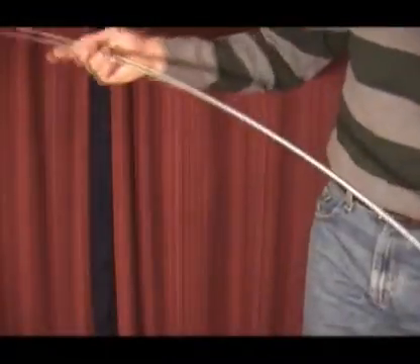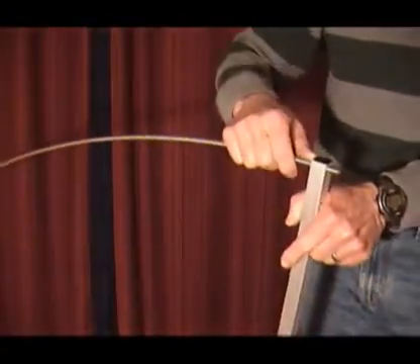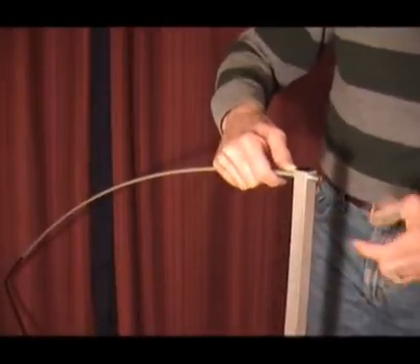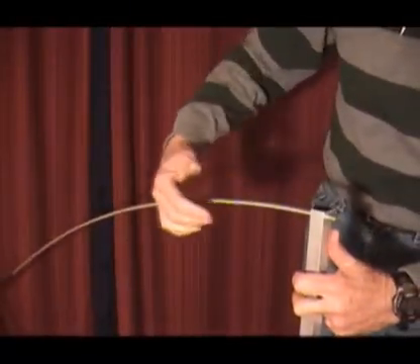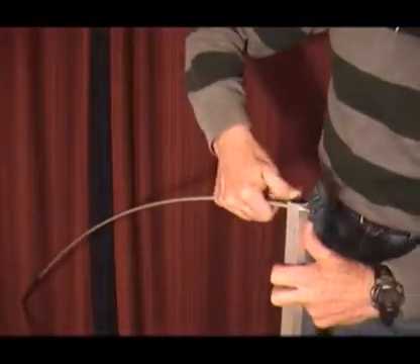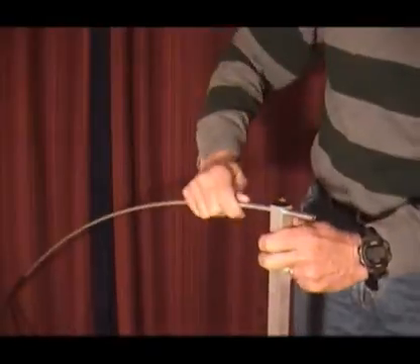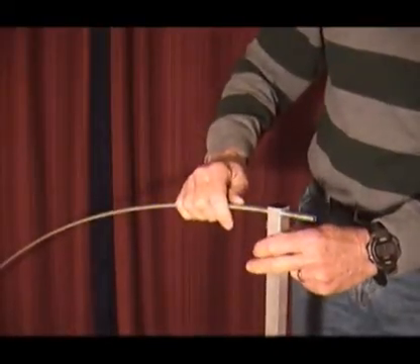Some people have asked us: do you need to put a screw into this joint or epoxy it? You cannot move that joint — it is locked. But to tune the antenna, you grasp the tube as though you were going to straighten it, and then just slide it in and out. You do it to both sides, and when you release it, it locks itself again. It absolutely cannot move.